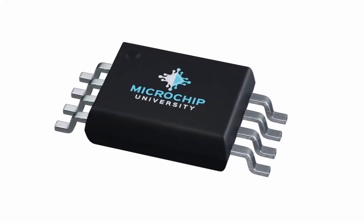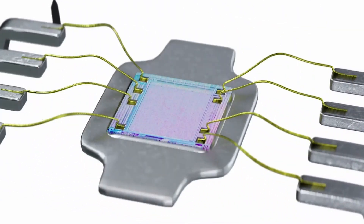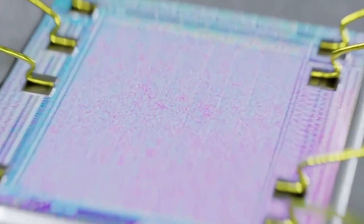Sure, Eric. Wear Leveling is a useful practice for maximizing the lifespan and reliability of your application because non-volatile memory tends to wear out with use. Whenever an EEPROM or flash device is erased and rewritten, the process creates molecular flaws in the crystal lattice that retains a charge within the memory cells.